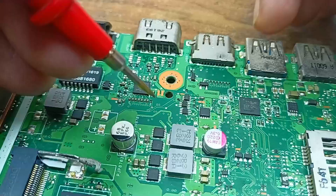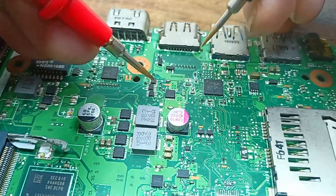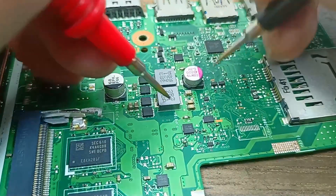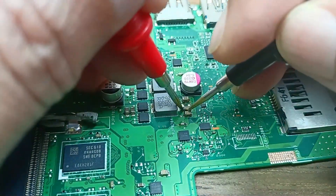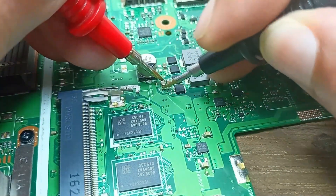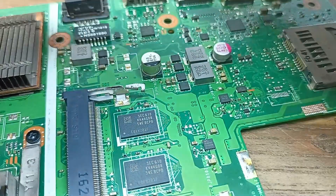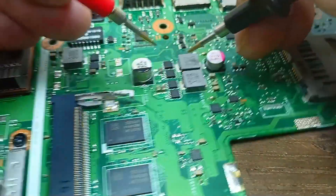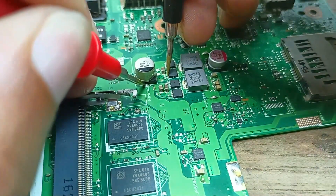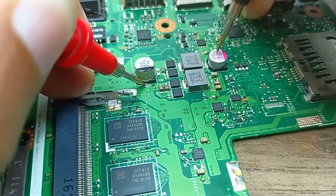This must be short and I need to check the other side. This MOSFET is okay, but there is no short circuit here. This capacitor — no short here, no short here, no short here, no problem here. But this MOSFET, and this MOSFET, and this MOSFET — this positive voltage is making a short.